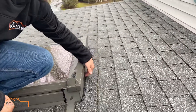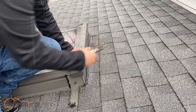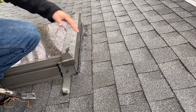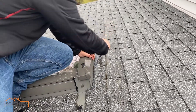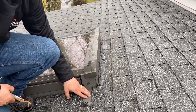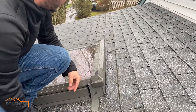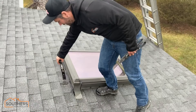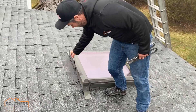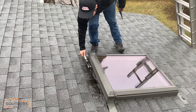What happened is they caulked everything, and now it's kind of ramping back. They did try to caulk a few different areas, but water's still able to get there. Once you have this flash pan, the water needs a space to be able to breathe, so that way it can flow out and come over this flashing pan. When you do it like this, it just creates a buildup to where the water can't even shed. You can see it's a pool. This skylight — same thing — the back pan, the shingle's running right up next to it, filled with caulking. You can see all this caulking to the point where there's a pool of water.